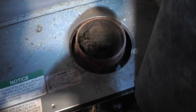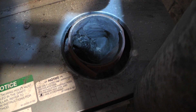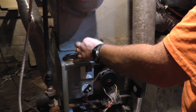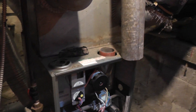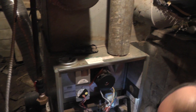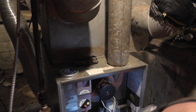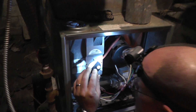There's not enough draft because it's shined down in there. Can you see it? There's a bird. Go ahead and back up — we'll get that bird out of there. Betcha she'll work now, but we have to get this fixed. Now I'm going to listen. Let's get close and listen to the pressure switch.